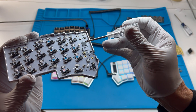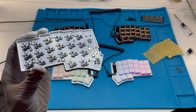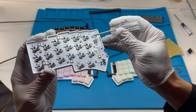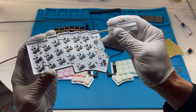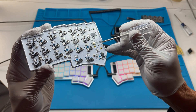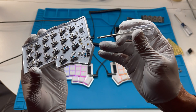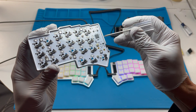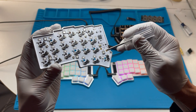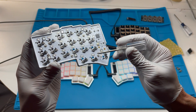If we take it off, we can see the components underneath. One notable thing is that the microcontroller is soldered directly to the main board. There is also ESD protection and fuses for overcurrent on the USB connector, as well as ESD protection and a fuse for the TRRS connector.